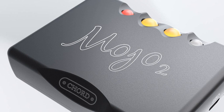The third thing, and this is probably the most important thing that separates my DACs from other DACs, is the reproduction of transients, in terms of their timing. This is the WTA filter. In terms of the M scaler, we're looking at 1 million taps. In terms of Mojo 2, we're looking at 40,000 taps. That's relatively a huge amount of processing going on. In the case of Mojo 2, we've got 40 DSP cores per channel doing the processing. And what this means is that the timing of the transients is being much more accurately reproduced.